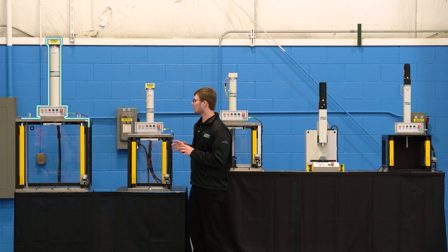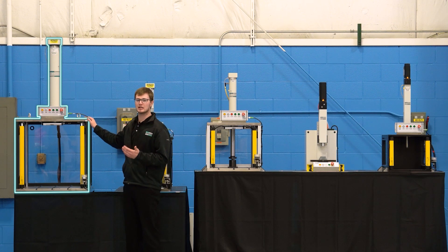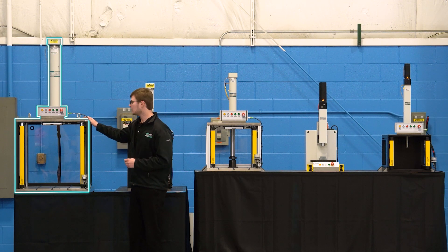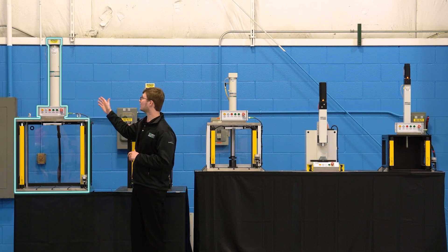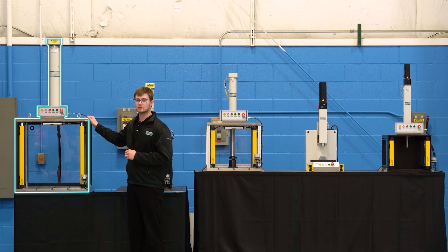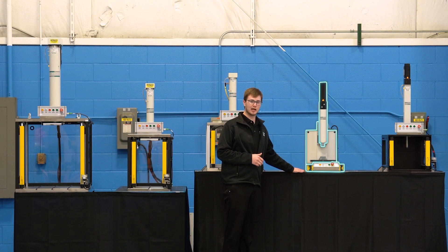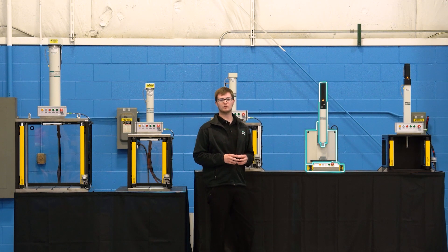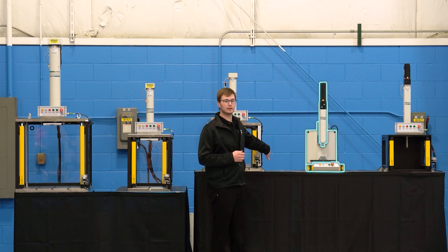If we move over one here, this is a small, tall benchtop workstation. Comparing the sizes, you can see it is slightly narrower, offering slightly less footprint than even the standard. Moving over one more, this is our first tailored benchtop workstation — designed around a specific application. This workstation is extra tall and wide and it also supports a 12 kN EMAP to provide a lot of force in a small package. This is the largest workstation that is able to fit through a standard doorway. Moving back over here, this is our L-frame benchtop workstation. The L-frame allows you to press on wider or longer parts without the obstruction of the guarding on the side.